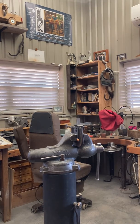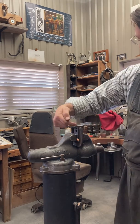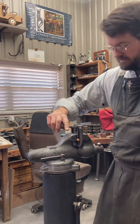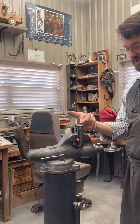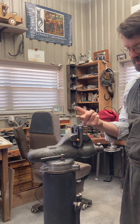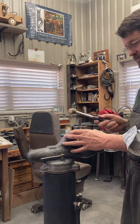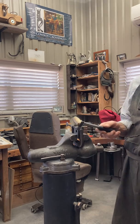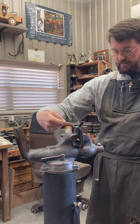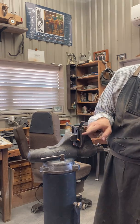Now, take a cute little brass hammer, and I'm going to concentrate my blows at the bottom side, down here. I didn't like that, because I want this to be pushed up all the way against that pin, and then I'm going to start wrapping it around. So at the bottom, my vise is in there. Now see how I'm concentrating my blows right in here, right there. Concentrate my blows. Now I'm starting to touch right here, and now I'm going to start working my way around.